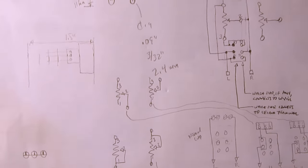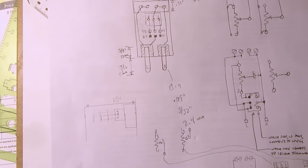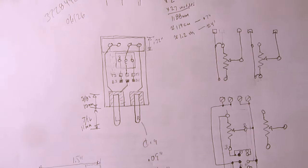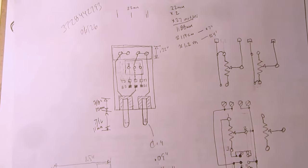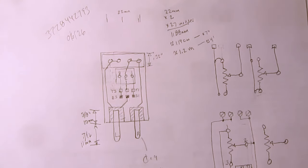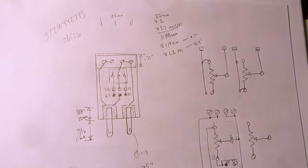And one concern is I was looking through the manual for the EC-1, and it looks like normally you've got voltages up to around 100 volts DC that you'll normally be working with on it. Although the power supplies go up higher, unless you're directly connecting to the power supplies, it shouldn't go that high. But it could get upwards of 200 volts, maybe a bit less, worst case. And then the normal power supplies are more like plus and minus 60 volts, so say around 120 volts if you were to connect between them.